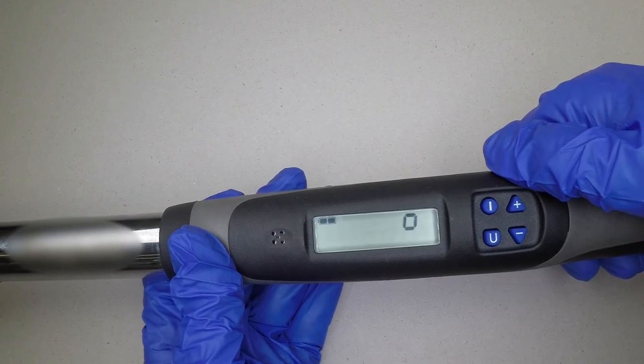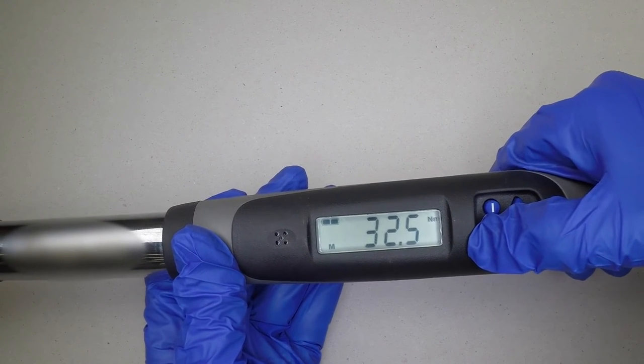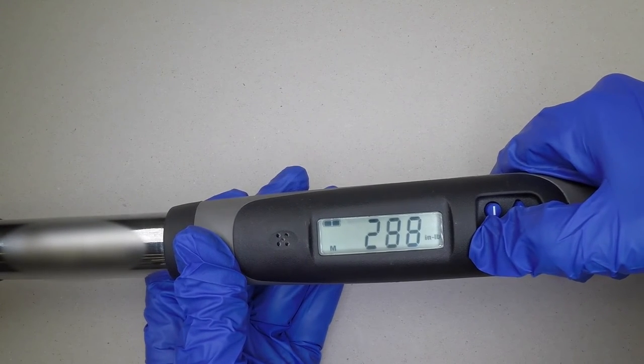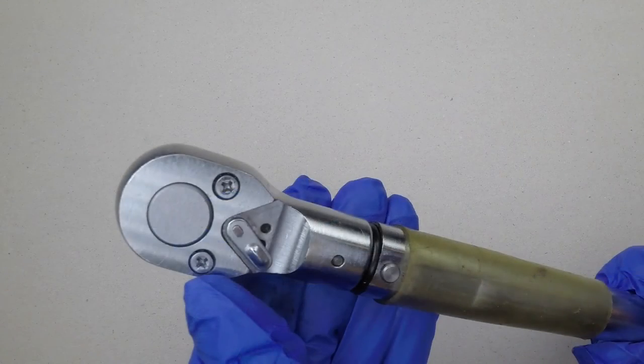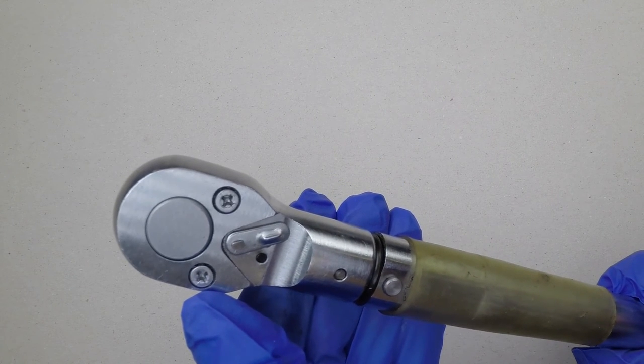Digital torque wrenches provide angle and torque modes with easy selection between Newton meters, foot-pounds, and inch pounds. Most torque wrenches are designed to torque in the clockwise direction only, although often the ratchet head has a switch for reversing the drive. It should be noted, though, that initial slackening is best done with a breaker bar rather than placing high load on the torque wrench.